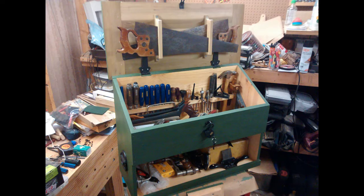The usual way to do that is to put some cross grain wood on the lid, either on the underside as battens — strips of wood that are screwed to the underside and run cross grain, which will resist the movement of the lid. But in my case I want to put saws on the underside of the lid, so I don't have space to put those strips of wood underneath.